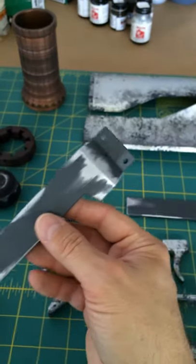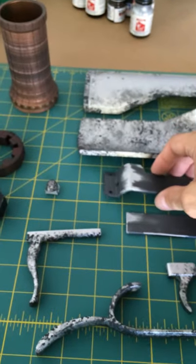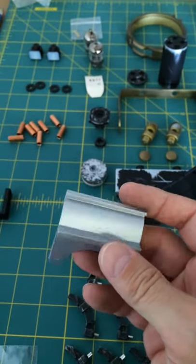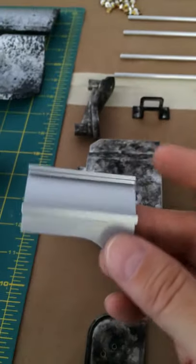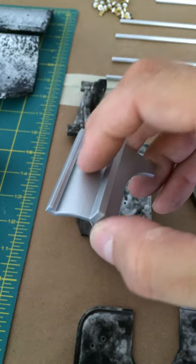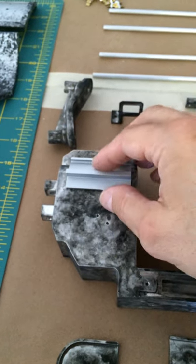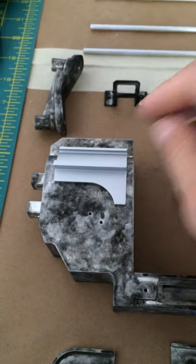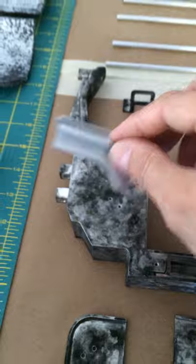Some parts I still have to finish. Some of these details are really difficult to machine into a whole part sometimes. So instead of machining something like this — which would just take a lot of time — I'll 3D print it and glue them in place. This is aluminum, and I'll do the same speckle finish on this and it'll blend in.